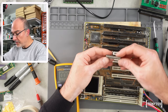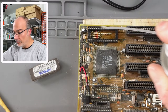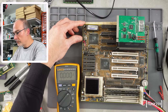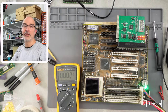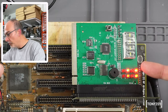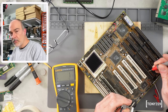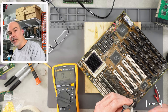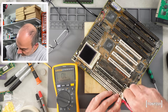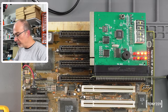Let's see if a fresh CMOS battery makes any difference — I strongly doubt it, but you never know. Completely, completely dead. So again, this is another board for a future video. We'll start from the basics: the clock, the reset line, the voltages, and move from there. Out of curiosity let me check the BIOS IC — some legs are a bit mangled but it looks okay. Let's put some contact cleaner on it, because without the BIOS you'd get no activity whatsoever, not even a 001 code. Still completely dead. Looking at the post card, it looks like plus 12 volts was missing, though there's continuity between the PSU pin and the ISA slot — maybe it was just the connector. Now we have 12 volts and it still doesn't work.